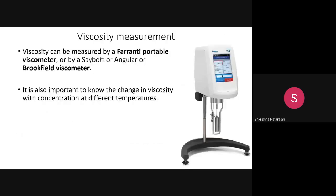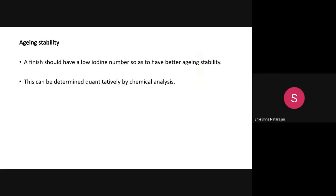Viscosity measurement: viscosity is the resistance to flow. The spin finish, being made of lubricants, anti-static agents, and oils, should have the required viscosity. High viscosity makes it difficult to wet the filaments. Experiments using viscometers — such as the Ferranti viscometer, angular viscometer, or the common Brookfield viscometer — measure how viscosity changes with temperature.